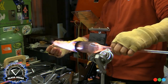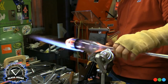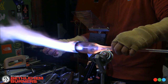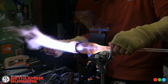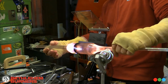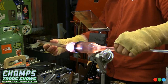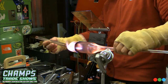And yeah, here it's really thick on that end. I'm going to heat up quite a bit of glass to make this seal. If it were a seal for the neck of a can or something, I'd be a lot more precise with it. It'd just be one little area, and everything would be perfectly prepped, such that that one little area is all that needs to get hot. But here, all that part in the back is completely sacrificial. I'm just concerned about it being sound enough to support the weight and not have any type of mechanical stress, which is like those acute angles and stuff.